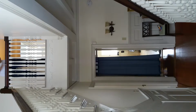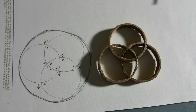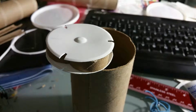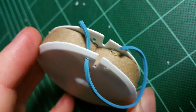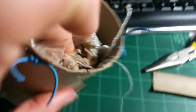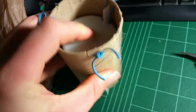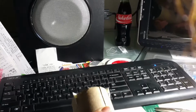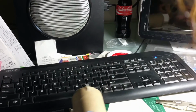With this larger container, I ran a few indoor tests to see how the parachutes would deploy from their housing. They did not. Upon seeing this, I designed an ejection system that would force the parachute out of its housing once it was released, exposing it to the airflow and hopefully opening before a hard landing. This new system worked fantastically at pushing out the parachutes. However, the force of the ejection system was too powerful for the current attachment system, pulling itself apart almost instantly when it was given the chance.